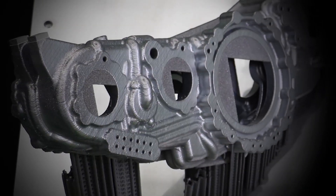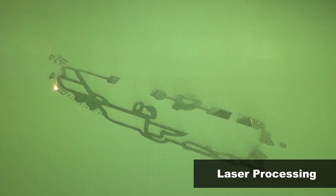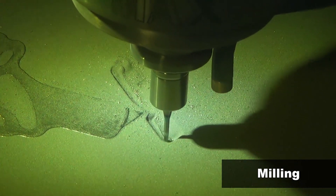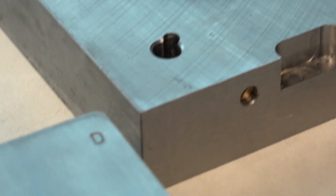Thinking about applications — if you're creating location points on components, that's important, isn't it? If you just printed them you wouldn't get much accuracy, but now you can machine those points too. That's a really big one — the CNC gives you that extra process all in one package, so rather than taking your printed part out and finding a CNC machinist, you can do the whole operation in one go, clocked up and ready from the start position. And with mold tools, channels inside components would get a much better finish too, because as you're layering up and creating the part you can machine those channels as well.